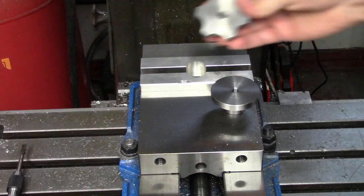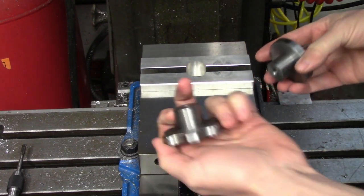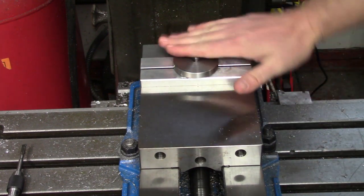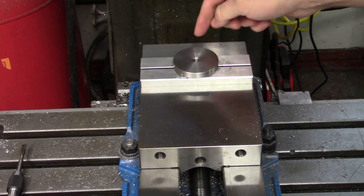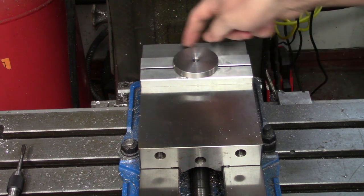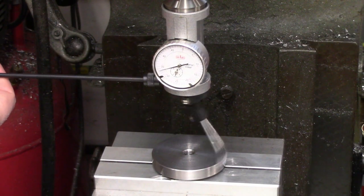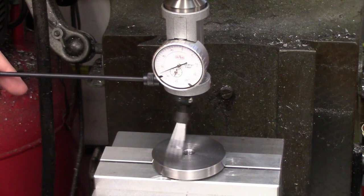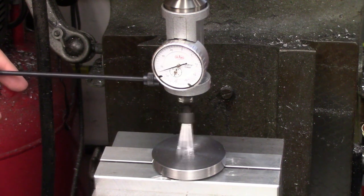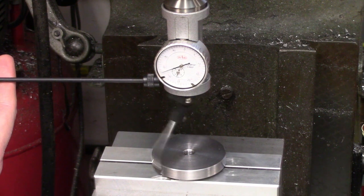To cut the notches on the knob, I'm going to use a set of soft jaws that I made back when I made my original table stop. These will grip the boss very securely and keep it from tilting, ensuring the part is held straight up and down. Now I can basically just make a bolt hole circle to cut my six notches. To do that, I first need to find the center of my part, and for that I will be using a coaxial indicator. These allow the dial to remain stationary while the indicator stylus circles the part. I'm looking for the needle to move as little as possible, moving one axis at a time until I find the spot where it moves the least. It often takes a few iterations back and forth, but overall it's a pretty fast and painless process.